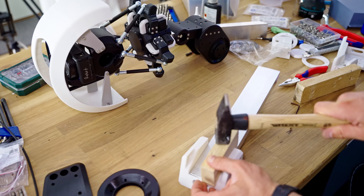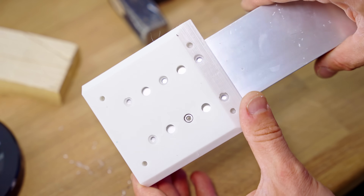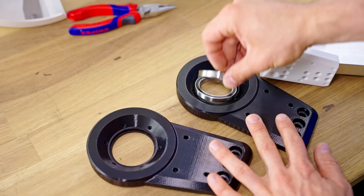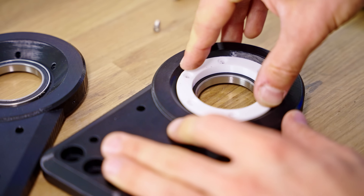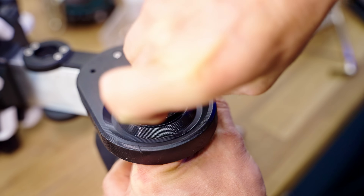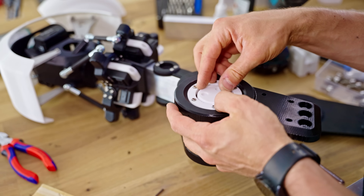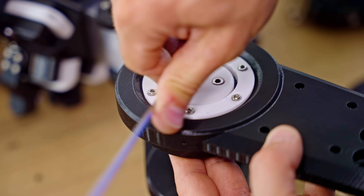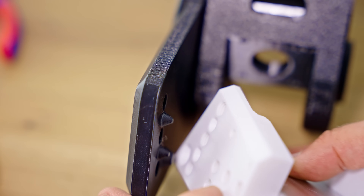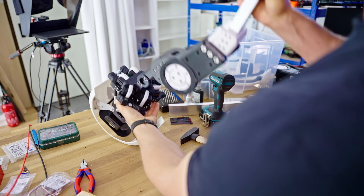I'm getting better at cutting these threads and not immediately stripping them out, but honestly, between the press fit of the printed part on the aluminum and tons of M3 screws holding these parts in, I don't think this is going anywhere. For allowing joint motion between each segment, I'm using thin ring ball bearings. These are larger than they need to be for the forces they'll see, but because they're so large, they spread those forces over a larger area of the printed part — making for a rigid joint even though the base plastic itself isn't that rigid. This connection needed to be multiple printed parts because it needs to clamp over the previous joint from both sides, so I made it as rigid as possible by adding pins and using the largest screws I could fit.